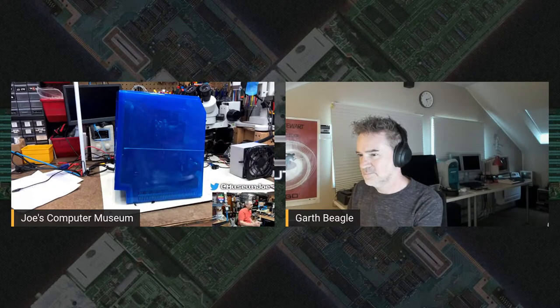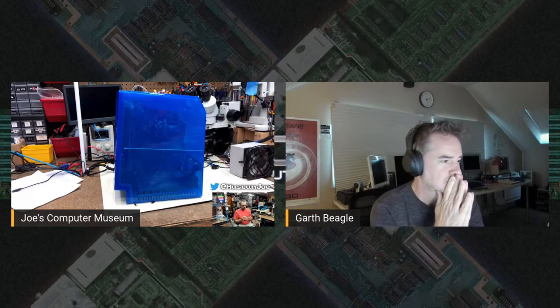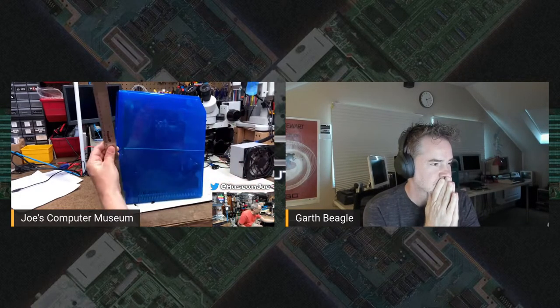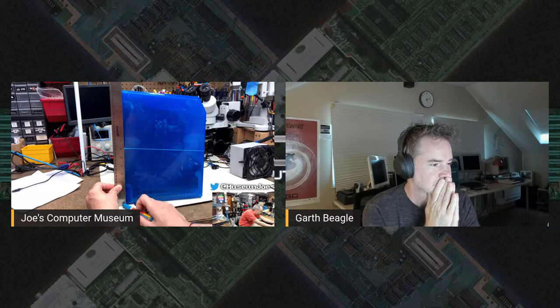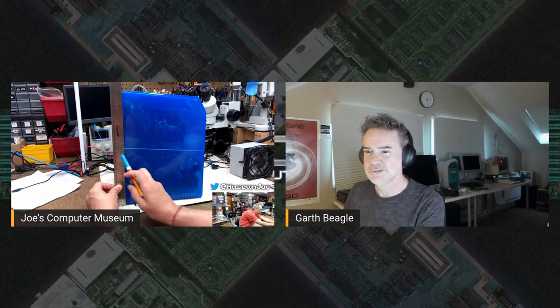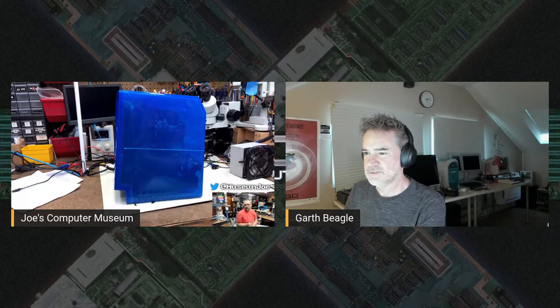And so then the other one we know goes right there. We don't have to worry about doing measurements there because we know where that is. Now here's where we do the measurement. We can figure that out from the bottom. It doesn't have to be an exact number, but basically this is at the 11 mark from there. So we can do that same mark on the other side, snap our line, and it will be the same on both sides.